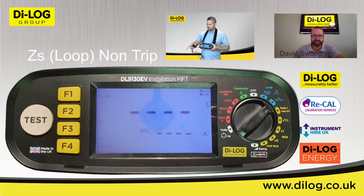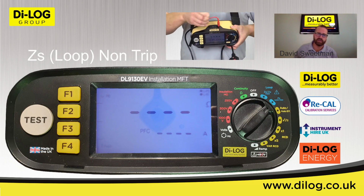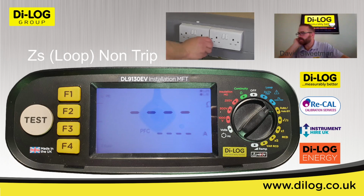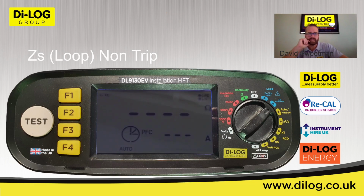Similar to non-trip on there. It's a 3 wire test that we conduct with the non-trip loop test, and again that has got a fully auto start function, so providing that Z auto is on the screen, which you can just about make out, it is there and it's all plugged in and connected. You can then perform the loop test very simply and very, very quickly, multiple times, or as many times as you want, really.